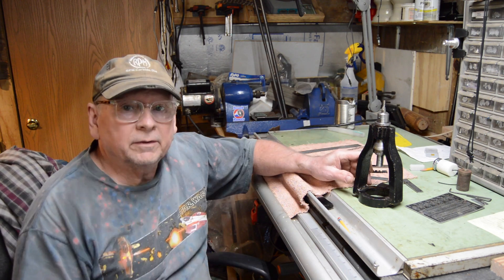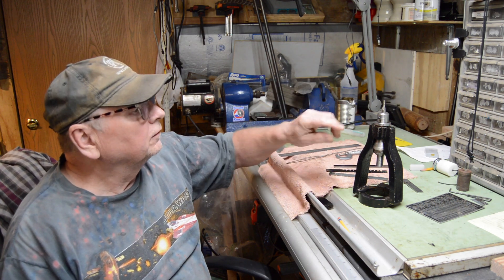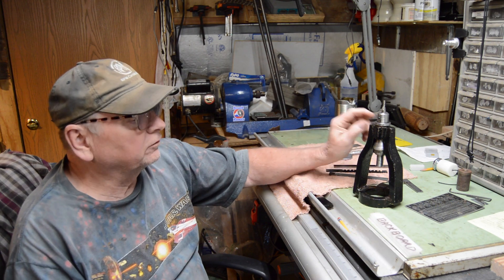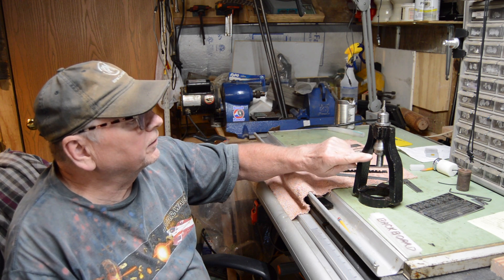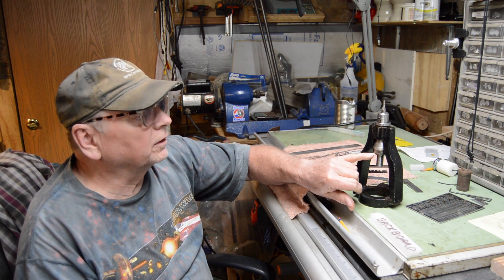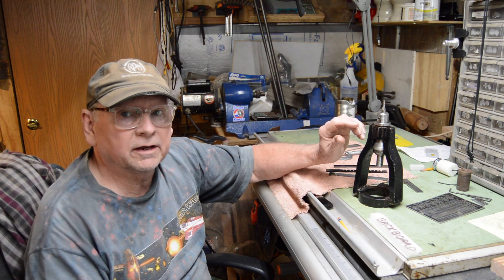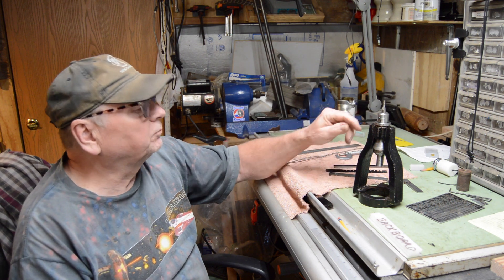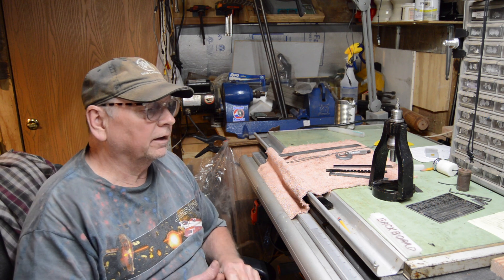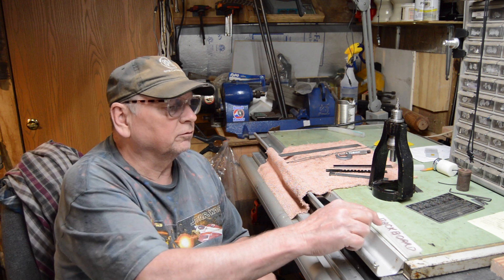I think I got this done about as good as I'm going to get it. I did all the rest of the machine you wanted this morning and got it up and running. I cut this piece with it. I'm going to go ahead and take some pictures of that thing. It's got some runout in it and I think I figured it out — while I was editing I saw some runout where the thrust bearing's one diameter is smaller, and I made the journal to fit that diameter. I noticed that diameter is running out and it gave me a little wobble, so I just need to pull it back apart and fix that up. I think it's going to work great for what I want. I filmed everything so I'll go ahead and put that up now and post the pictures at the end.